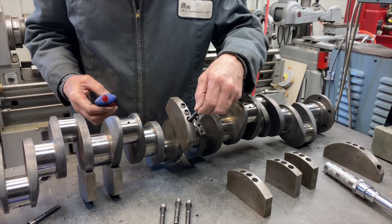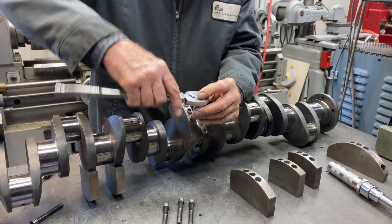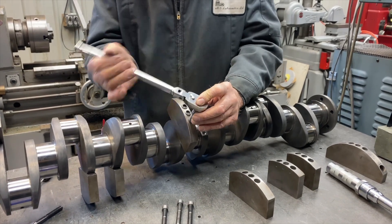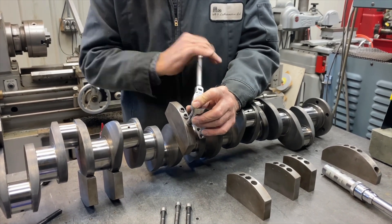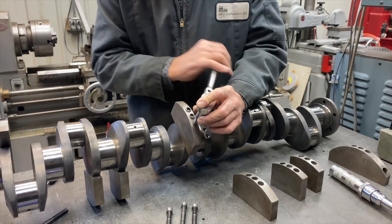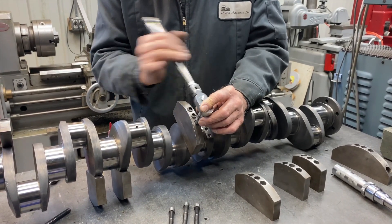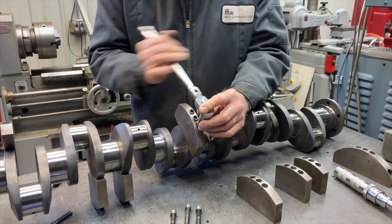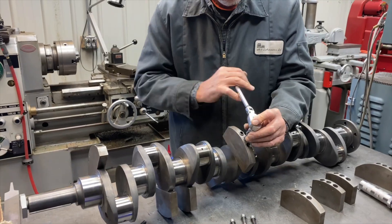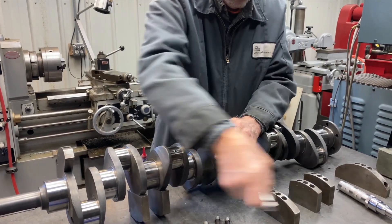They had removable weights on the crankshaft and you have to remove those weights — if you don't, you won't be able to grind the whole journal because it overhangs the rod journal. So we have to drill them out, then go ahead and grind the crankshaft. We nitride and harden them so that modern insert bearings ride much better on that hard surface. The weights then have to be put back on and the whole assembly balanced.